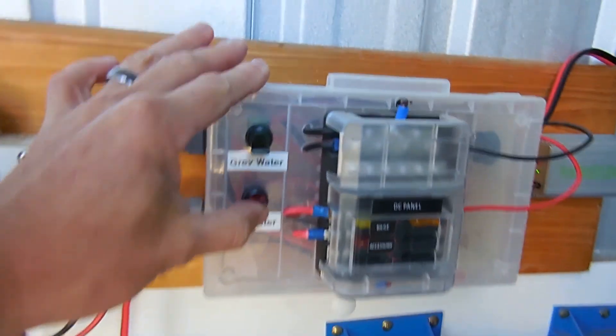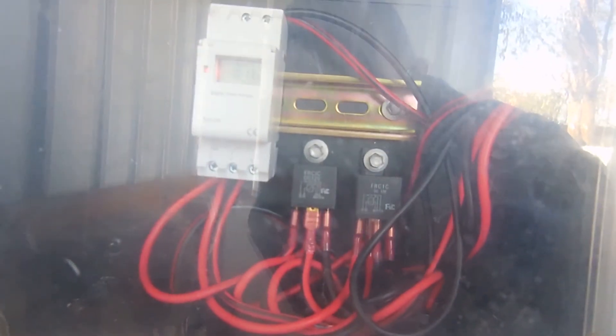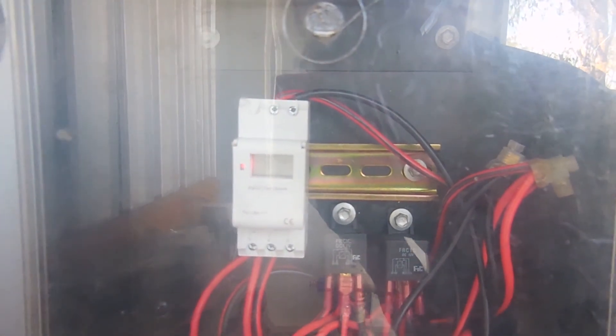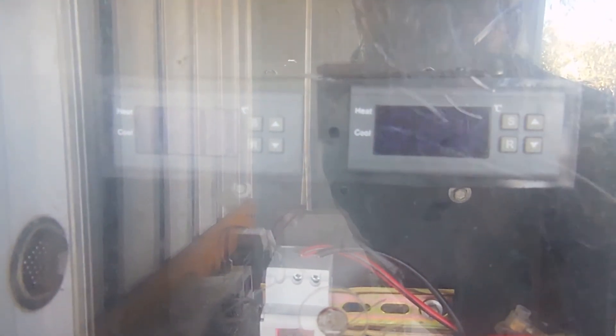It also provides power to the circuitry over here which I haven't finished altogether. We've got that switch which controls a relay that switches the pump off. We have two relays — one controls the pump, the other one controls two solenoid valves — and we also have a timer in there. It's not fully set up at the moment; we're basically just running off a timer set from 9 a.m. to 3 p.m. every day. Once we hit 3 p.m. it'll automatically switch a relay off and disconnect the 24 volt solar panel from the pump. Above we have two temperature controllers — one analyses the temperature on the roof and one analyses the temperature in the tank. When the temperature on the roof is hotter than the temperature in the tank it'll turn the pump on, and if it becomes colder on the roof than what's in the tank it turns the pump off. But I currently do not have that connected up — we'll get to that in the future. Currently it's just on a timed system.